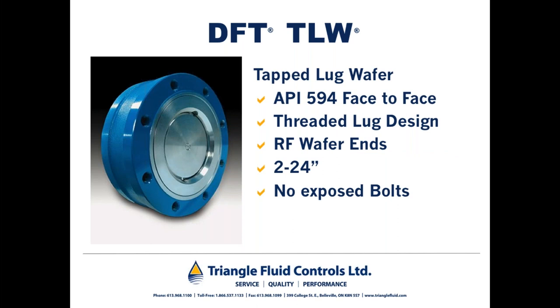Next, we have another wafer style valve. This is the TLW tapped lug wafer. A really important feature about this valve, ladies and gentlemen, is that the bolts are not exposed, but we still have a wafer style valve. There are several facilities out there that do not like to have exposed bolts. So if they want to utilize a wafer style valve, this is an excellent choice.